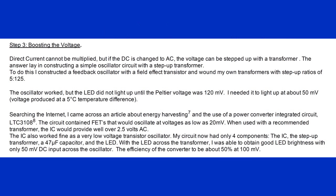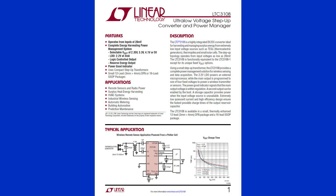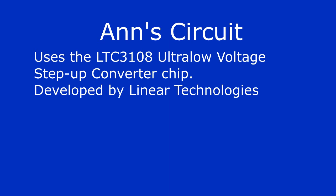According to her Google Science Fair project page, which you can check out in the link in the description below, she uses the LTC3108 ultra-low voltage step-up converter as her circuit. This chip, which is developed by Linear Technologies, is efficient and perfect for an ultra-low voltage input down to 20 millivolts, which is perfect for this project.